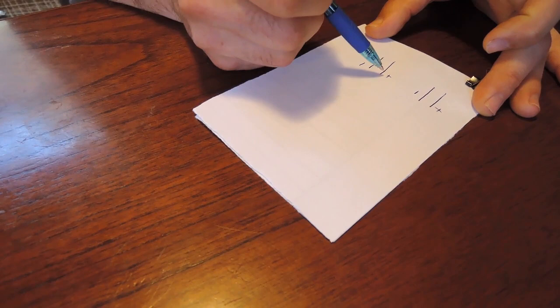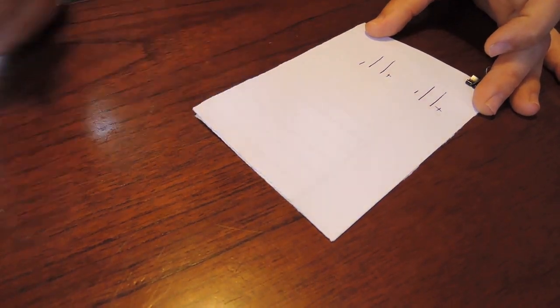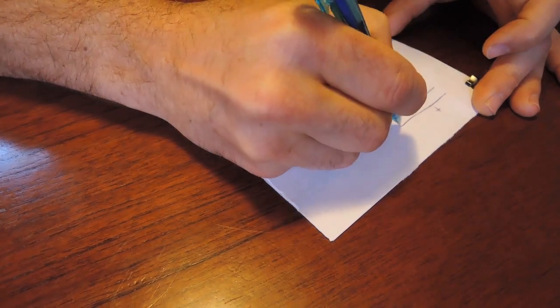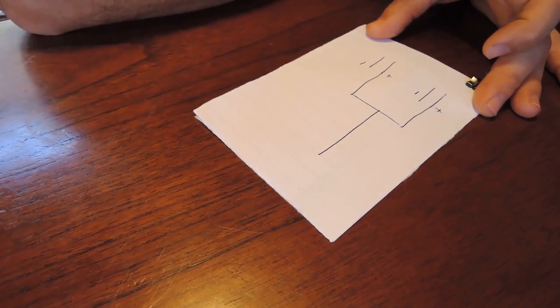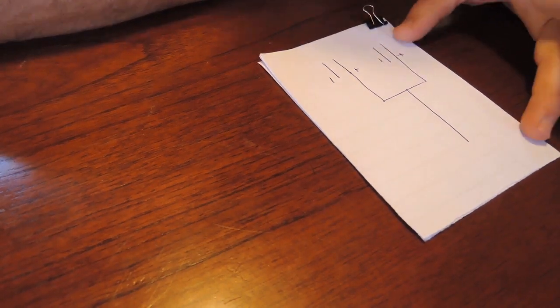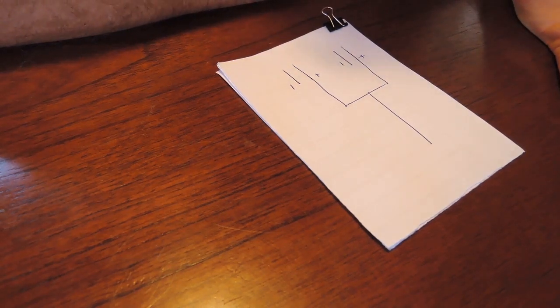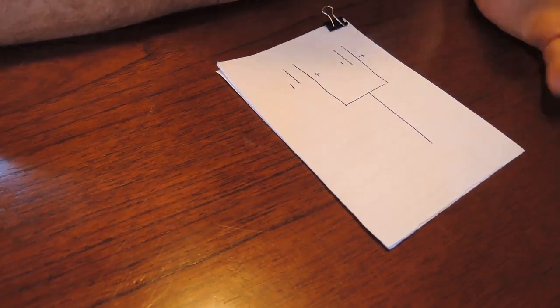So we're wanting to join these two plus signals, or the two audio signals, together. Now I guess in theory you could simply join the two together, but it's not a great solution. You're going to end up with undesirable artifacts. You would possibly get distortion and a degradation of the sound. We don't want that. So instead what we can do is use resistors in this way.